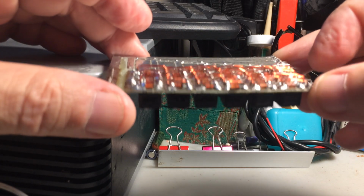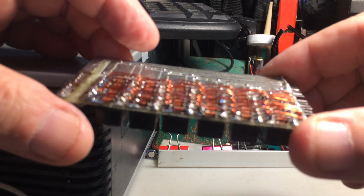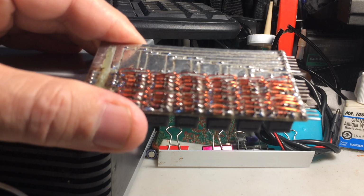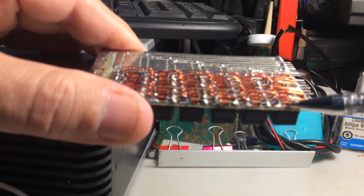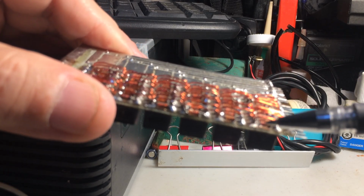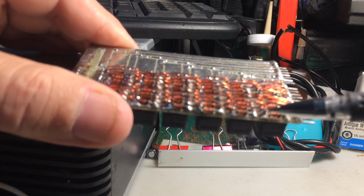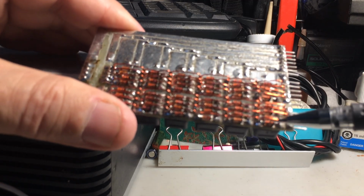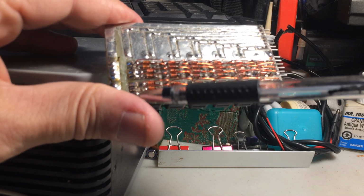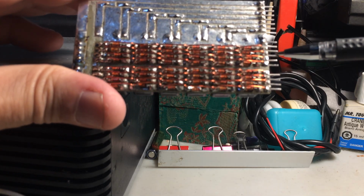So, on the back side, you can see, if I bring it up closer here, hopefully it'll focus, that there are diodes. These are actual diodes. I'm not sure if they're visible here, but right in here are diodes. These are little 1N914 diodes, and what you see going across the diodes are simply wires, and these wires actually connect from the resistor side and continue all the way down to the data output lines.